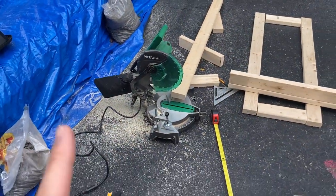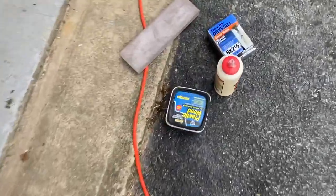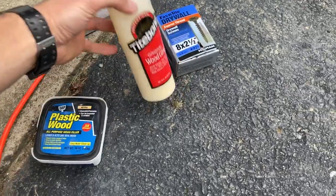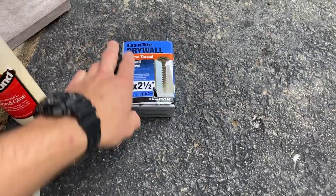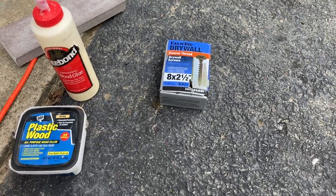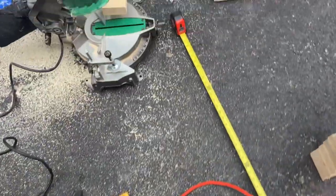I've already started making some of my cuts. You'll need a saw, you'll need some clamps for later on. This plastic wood is really nice — it's gonna hide all your flaws and things like that. You can use wood glue, I'm not positive when to use it or not. I'm using number eight two-and-a-half-inch screws — drywall screws — because I think it bites better than wood and doesn't split as easily. Deck screws are stronger but sometimes they kind of strip towards the end.